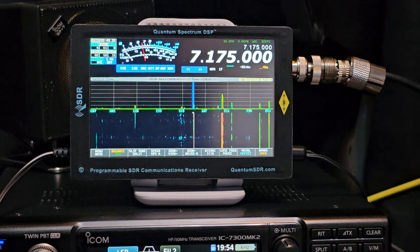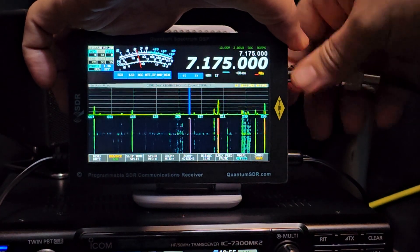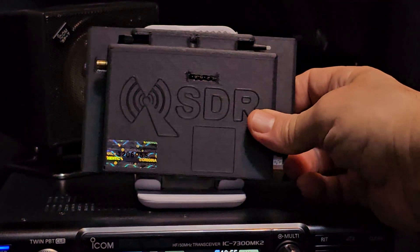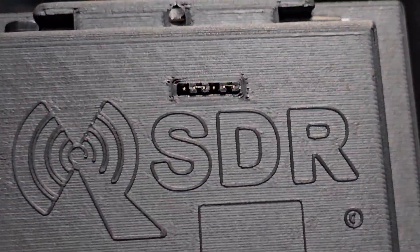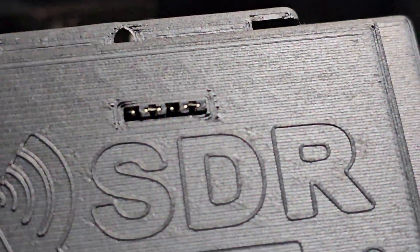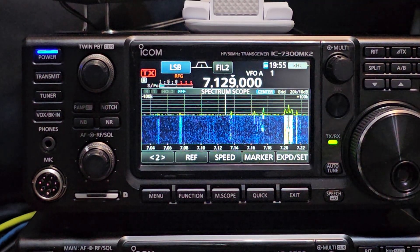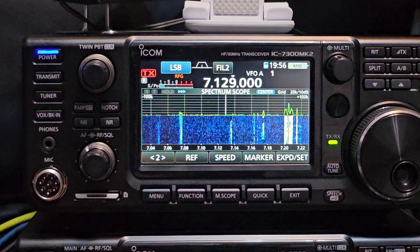Sorry if that was a bit fiddly, but we're getting there. On the back — I'll take this off now completely. There is a speaker connection just there, I don't really need it. If I completely turn this round, you'll see — see the words 'SDR'? These two pins just pull off and move to the left, and then they're back to normal. In the receive and RF mode, you want them to look like that. On the back of the 7300, there's just two SMAs. The one nearest the big fan is the receive antenna. The one furthest away is the one sending out the RF. I think it's great fun. Thanks for watching. Bye for now.